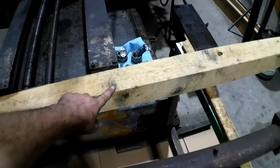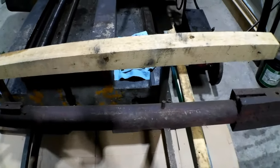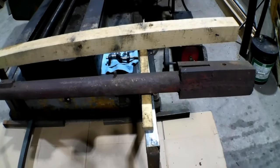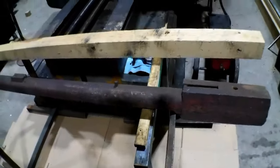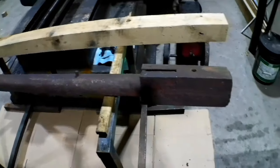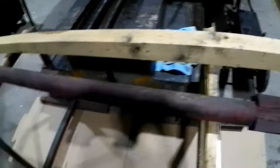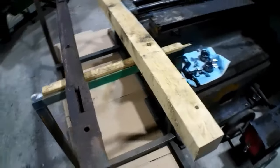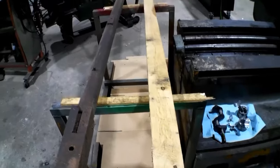This staining right here — that's blue stain. That is from iron. Actually, when you're sawing oak on the mill, if you see any of that blue you stop immediately, because that means there's probably a nail or something in the tree — a good indicator that you've got a problem. This is the tongue that was on it and I really don't like it, it looks like garbage. But this is the piece we're going to treat in linseed oil — it'll take a lot of coats, soak in most of the way, and then we'll get on the metal work.